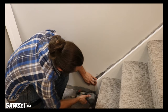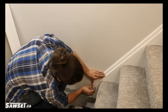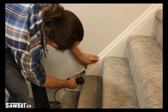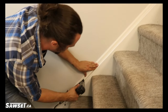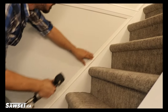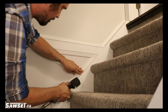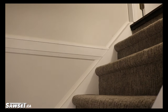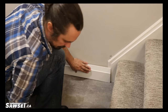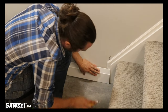Now I'm moving on to a little bit of shoe molding that we're running along the top of the staircase. I went with shoe molding — in this case you have other options. Some people run baseboard all the way up. I do too, depending on the situation and what look you're going for. Here, we're just trying to keep it simple and sleek. Shooting with an 18 gauge nail gun here. Probably should have pulled out my 21 gauge, but I was feeling a little lazy. 21 gauge are nice for small little pieces of shoe molding like this — less chances of it splitting, it's a lot easier to fill, and you can just fill it with caulking.